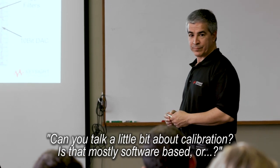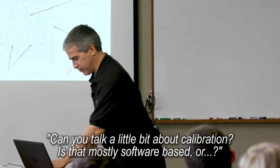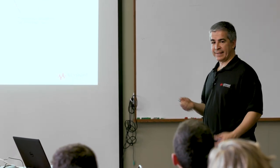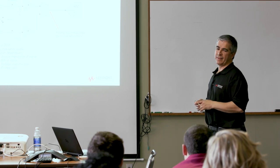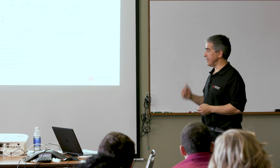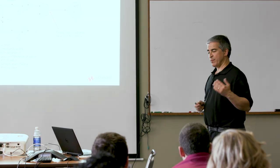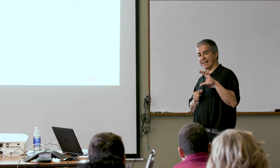Can you talk about calibration — is it mostly software-based? I'm not an expert on calibration, but: one thing calibration has to do is account for chip-to-chip variation. For example, nominally if I click in a gain of two, I'd like a gain of two — but because of process variation and variation in the attenuator, it might not be exactly two. One of the simpler calibrations is figuring out how to get the gain to be what we want given process variations. One approach is sending a DC signal — from a resource on the board — that we ramp through the front end. There's an offset DAC and a voltage DAC that of course also have to be calibrated.